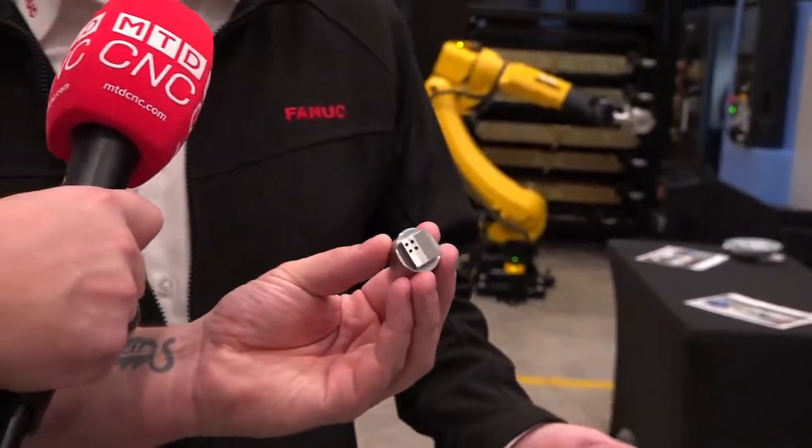But even the surface that you're drilling into when you're micro machining has got to be flat. It's got to be smooth. It can't be rough. At least a little ridge in the part, and you're going to skew that drill and it'll break. So there you go, micro machining on a robo drill.